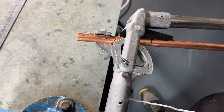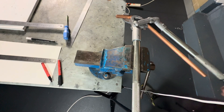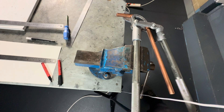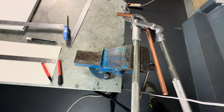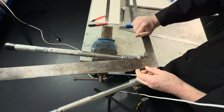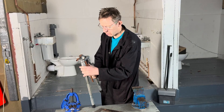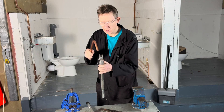Because we want to be accurate, we're going to check it with a square. If you're being assessed, never trust the markers and the bender — always verify it with a more reliable source. We can now see it's in line, like that. We then take the pipe out.